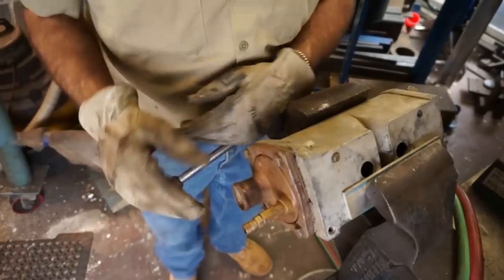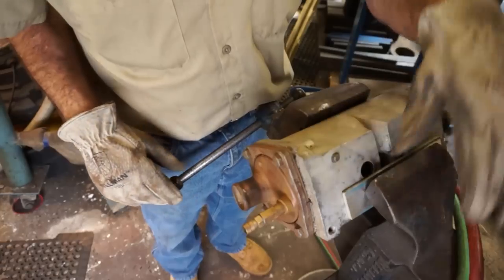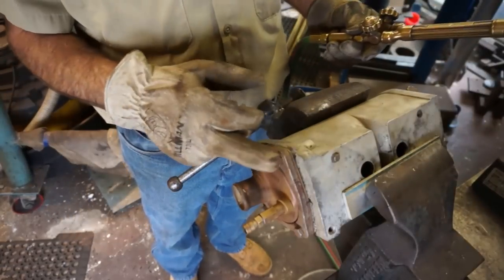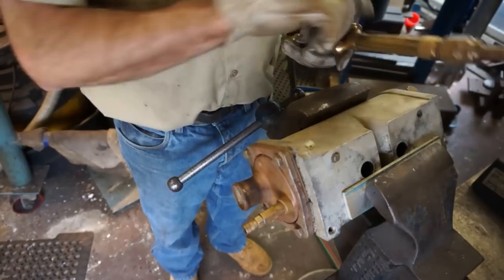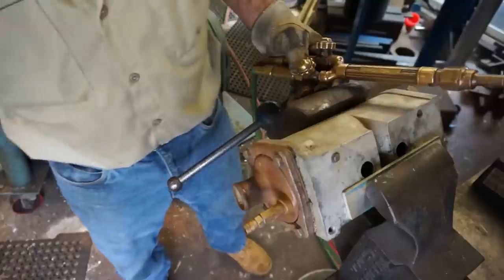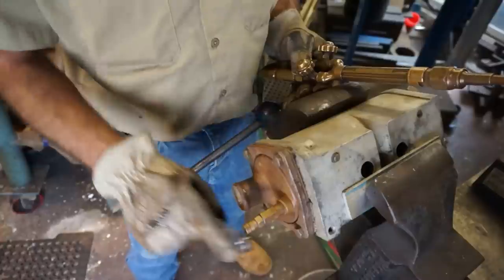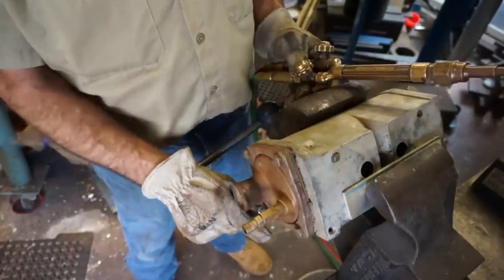All right, we brought you in here close. I got this in the vise here, and I got a piece of aluminum sandwiched in between the surface so the vise doesn't bite into it. Not that we're going to hammer or bang on this thing. I should be able to heat here and break it loose with a nut or the wrench here on the hex of the bolt. I thought these were Volvo, I thought all metric, so I thought these were 13 millimeter, but the half inch actually fits a little tighter on worn or rusty 13 millimeter hexes.